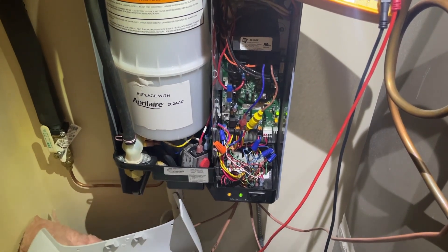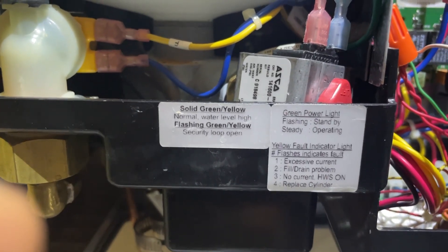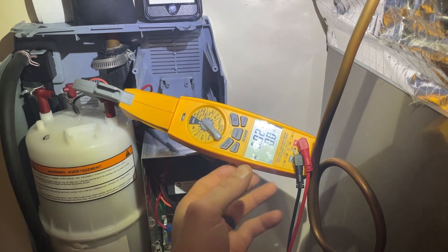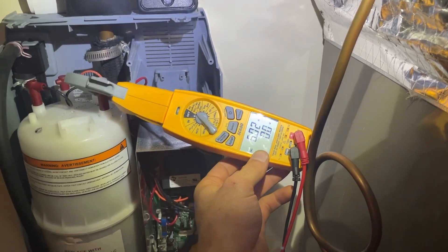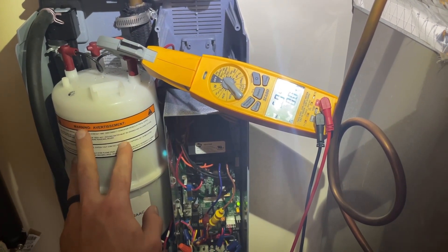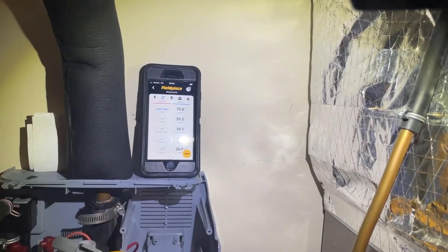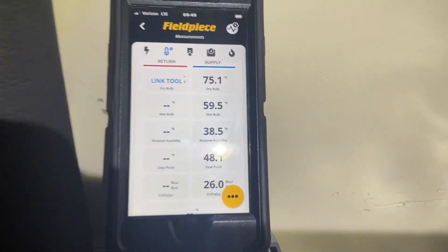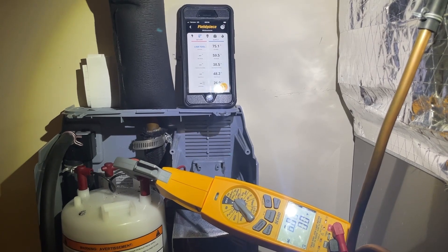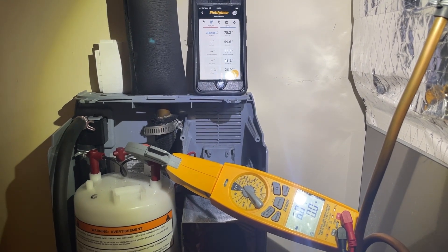This light here just came on, so let me look into that. Solid green is normal. Yellow is water level high. I am starting to get some steam — it's hard to see in the lighting — but my current is coming up steadily, which makes sense because as the electrolysis or whatever takes place in this canister, I'm going to get more and more ions dissolved into the water. This canister is very hot now. I'm going to be looking at my humidity. That's the humidity in the closest duct. I checked the humidistat and it's accurate within reason, several percent, which is fine.